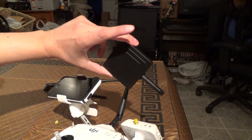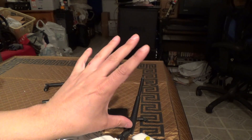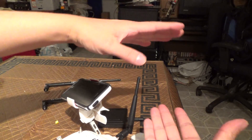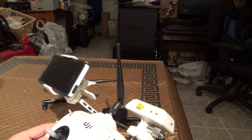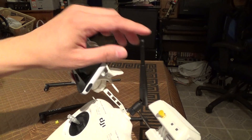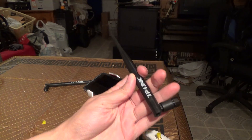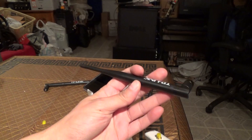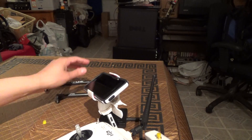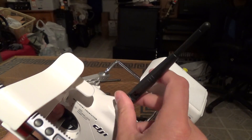The beam is about 35 to 40 degrees, so you really need to make sure you're pointing well at your device. Also keep in mind the higher dB gain you go, it starts compressing your signal to more of a donut shape rather than high. So if you're flying at really high altitude you'll have to point your antenna a little bit higher. For most people, a 3dB gain antenna is going to be more than adequate, and a 5dB gain will easily push a few kilometers.